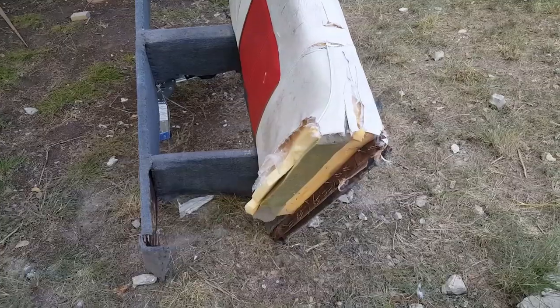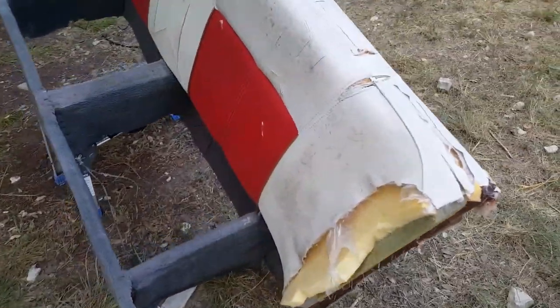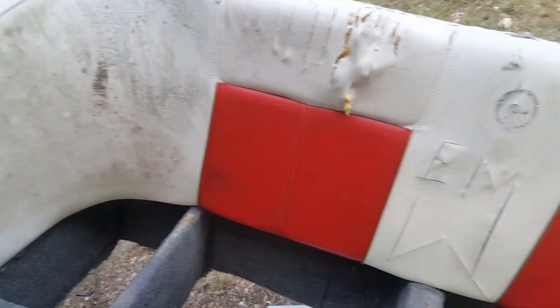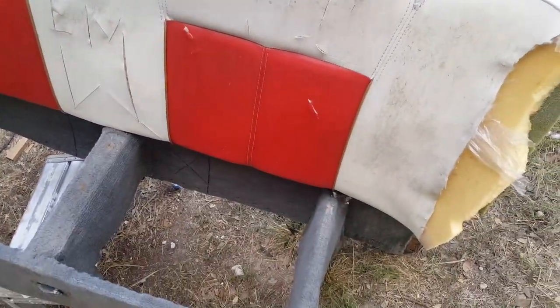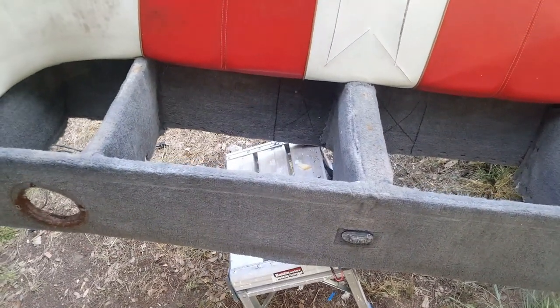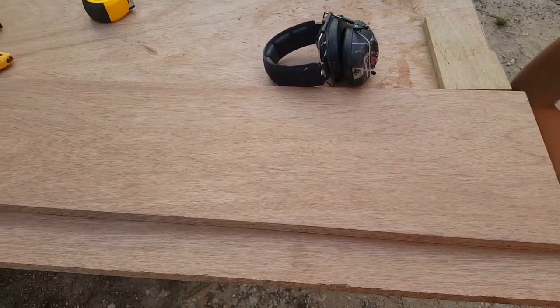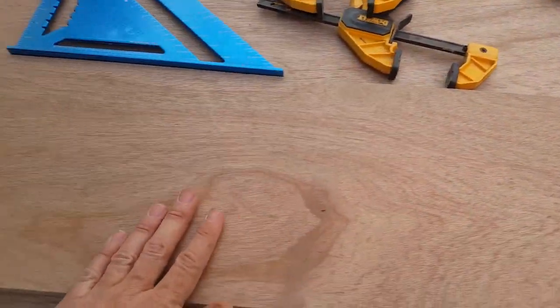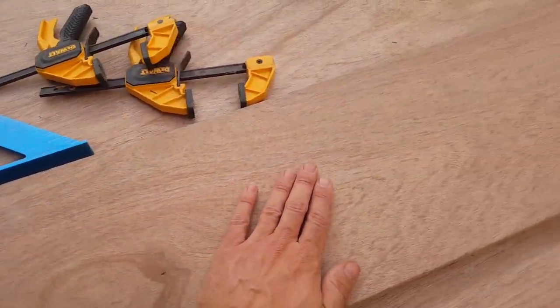You can see here how I demoed the side so we could capture that angle — that piece is good and it's gonna match our other little side over here. So we're gonna do next is measure this base piece. We know it's gonna be 73 inches wide, so we'll keep that as is, but we do need to measure the height on that. I cut the front piece now at 10 inches, and allowed for the sides too, so I cut about an inch and a half off the end so it'll fit on the sides and you won't see the screws.